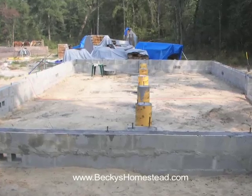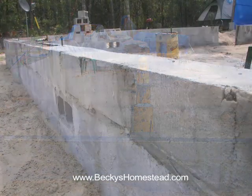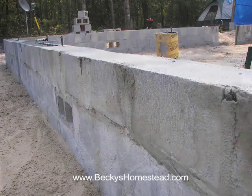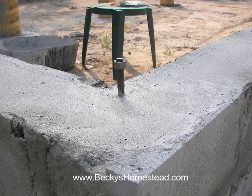We smoothed it out, and I started laying block. I mixed the cement with a hoe in a tub and just started laying the block, just block on block. Basically, it is repetition. After I got to the top and passed my second inspection, which I happily did pass, the cement truck comes again, and you pour the top U-shaped blocks solid.